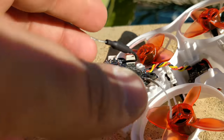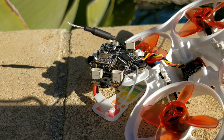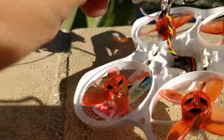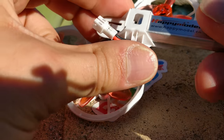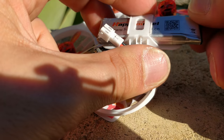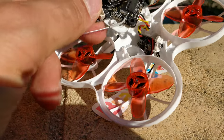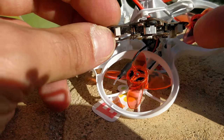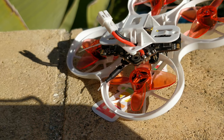I'm also going to try to make a frame for the TinyHawk, because this TinyHawk board performs really well and it's an F4 — I really like the F4 performance. Because it comes with this little battery holder on top, I'm going to try and design a frame that puts the battery on top so you can slip the battery right into the holder and take advantage of how nice and secure it is. The board is going to sit inside the frame upside down, and I'm going to solder on the motor wires and see how it performs — that's the one I'll put the 0804 motors on to see if putting the battery on top makes a significant difference.